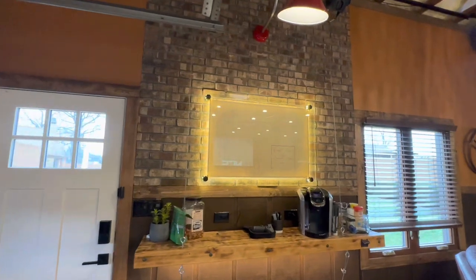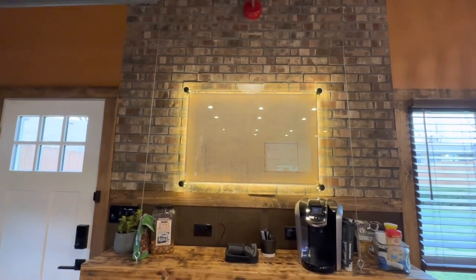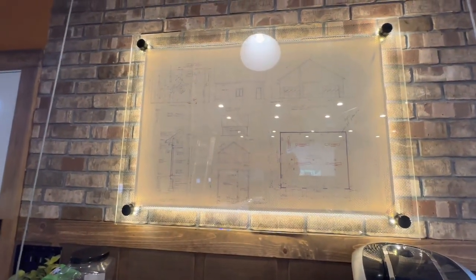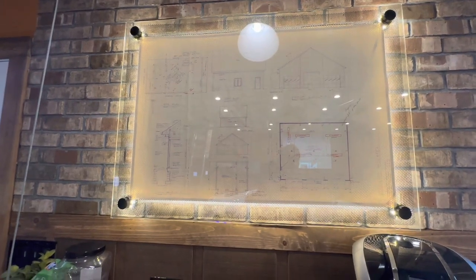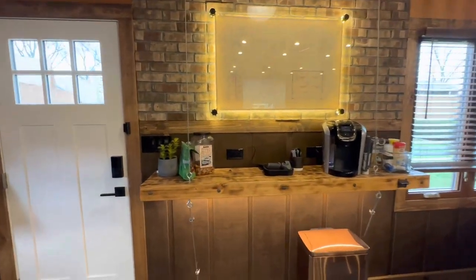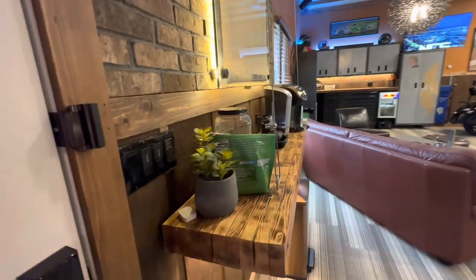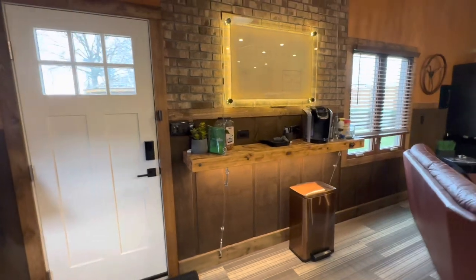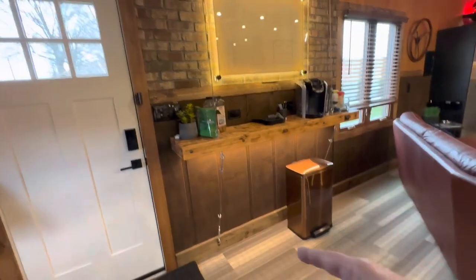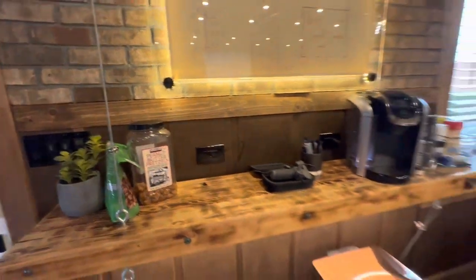When we bought this house — we've been here about four years now — one of the really cool things was that I got the blueprints for the house, the landscaping, and the barn. It was a no-brainer to display those prints. I got a piece of plate glass made, did some LED lighting, and sheared a little piece of perforated steel to hold it all in place and display the blueprints above a hand-built coffee bar. The coffee bar is leftover two-by-fours lag-bolted together on standoffs off the wall, which made it a little flimsy. So following the industrial theme, I went to Harbor Freight and got galvanized wire clips, turnbuckles, and eye bolts to tension them. Once all tensioned up, it is super sturdy and has a really cool look.